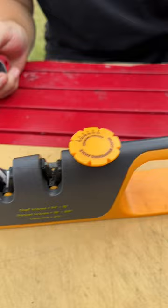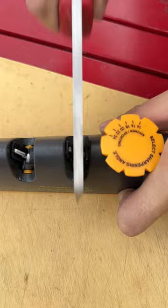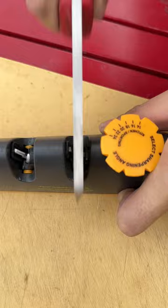To make it sharp, we're going to change the angle. 14 is too thin and the knife is too thick — 16 is the way to go. Hold it steady. Stop dragging, baby. Once you see a new edge forming and there's some burr laying on there, go to ceramic polish.